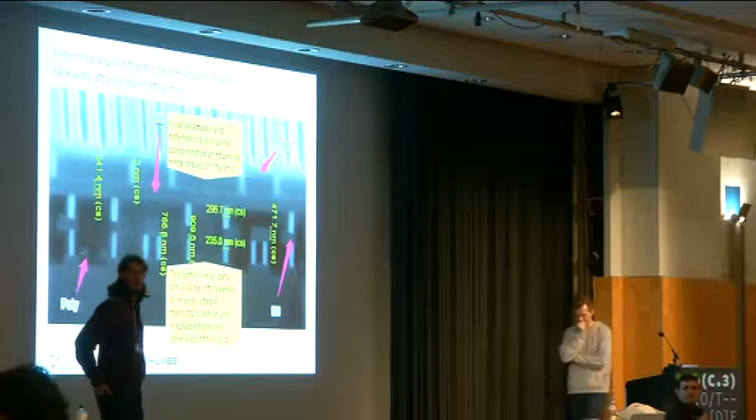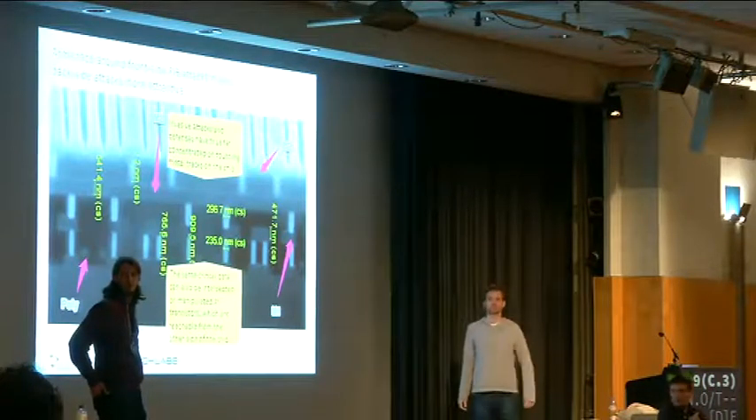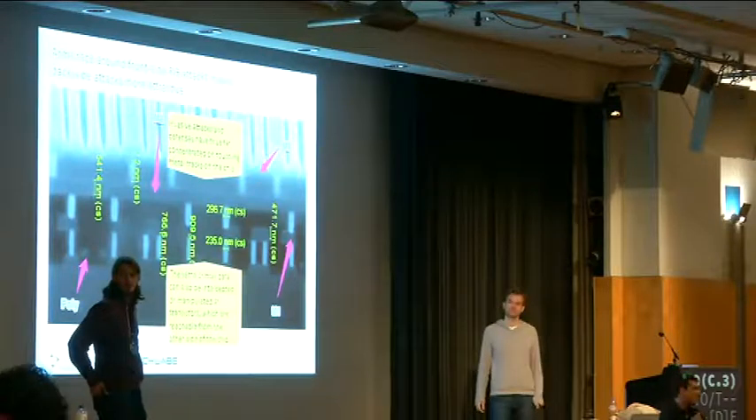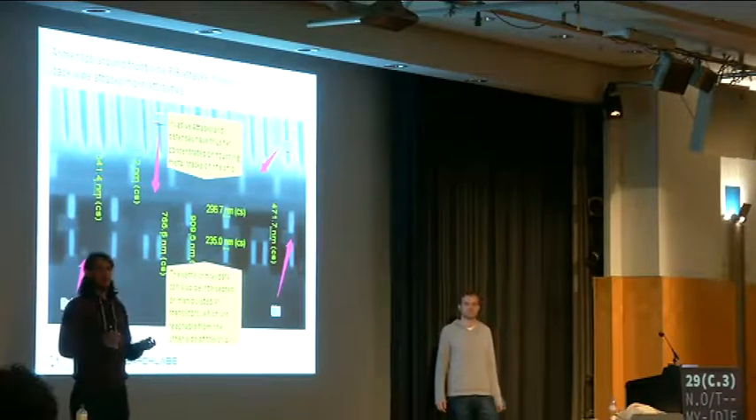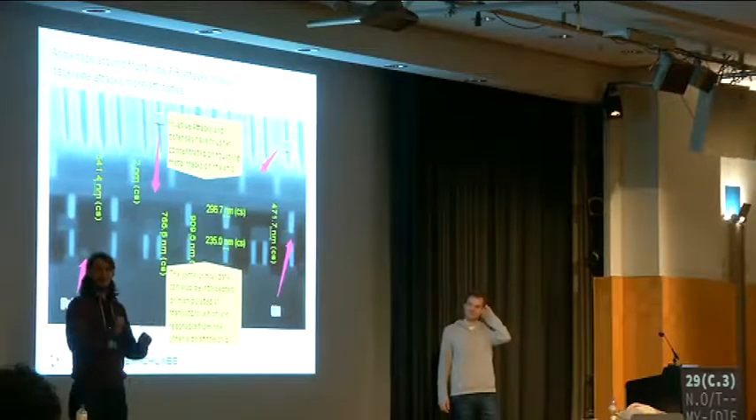Q&A on scratching technique: Someone asked whether a piezo actuator giving vibration to the probe would work, like a dentist removing dirt from teeth. We thought about that, but scratching is more feasible — you have full control with the micropositioner, you move it back and forth or rub it alongside one of these threads and suddenly it breaks. It's doable and with practice becomes very reliable.